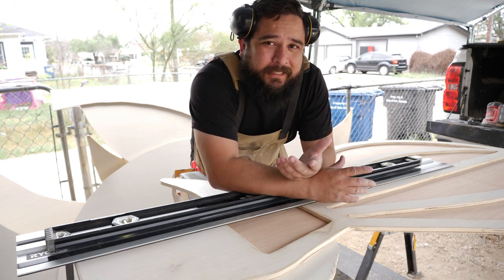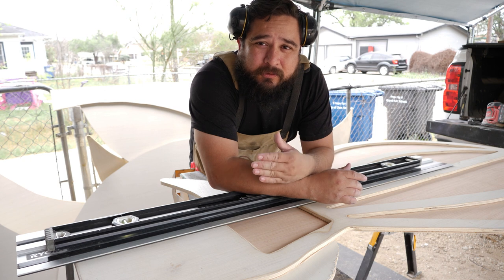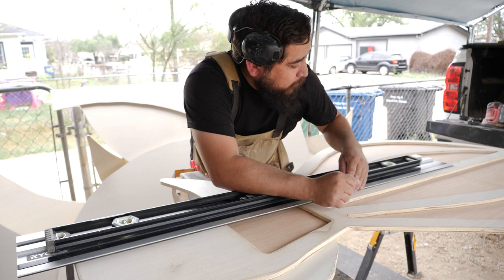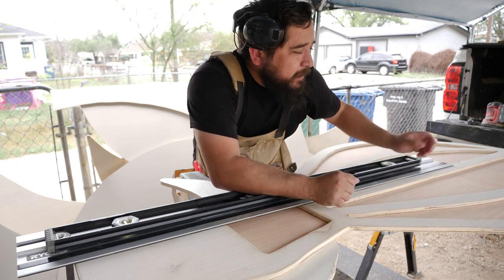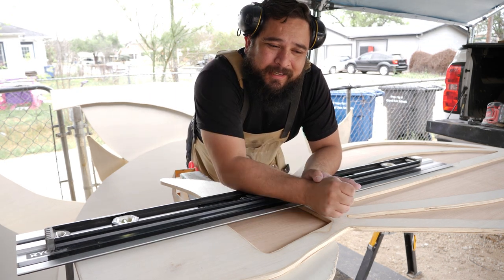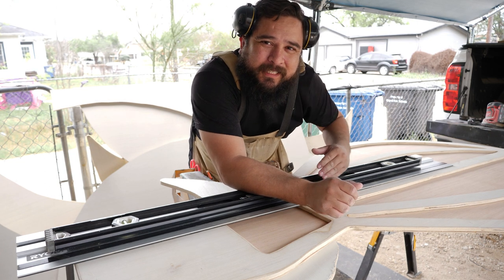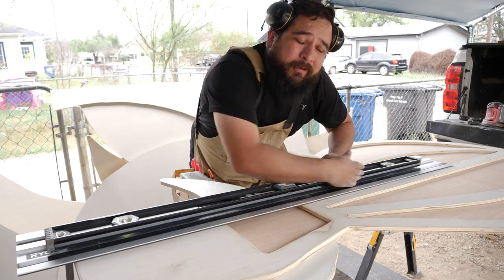Just anything that's going to be over 6 feet, like a piece of angle iron. You will have to take some measurements to make sure your saw blade is right in the center of where we want to cut, but you just clamp each end and then use your saw against it as a guide, all the way across. You can try it freehand, but it goes super slow. It's always better to have a guide, something on the side that holds, that you can use your circular saw to guide against all the way across.